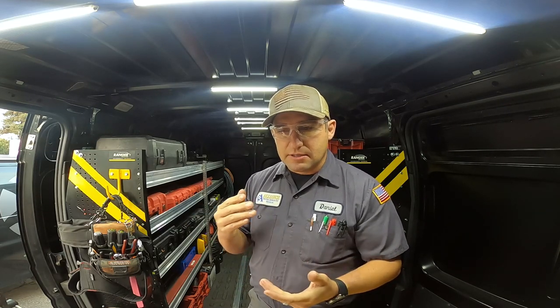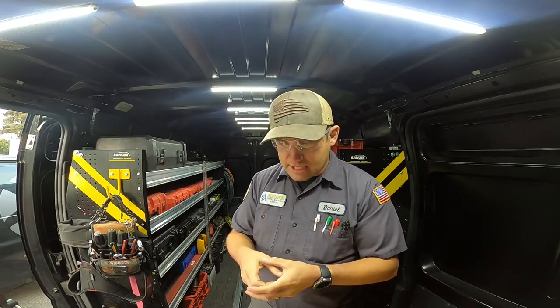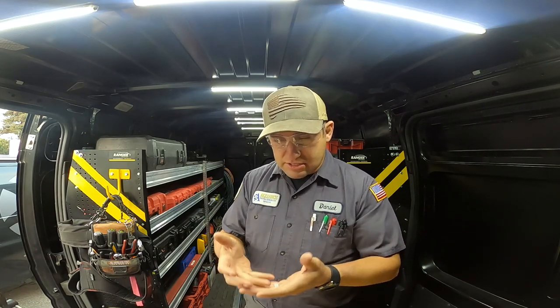And it just sucks that my customer had to pay almost $30,000 in Freon, and now he's gonna have to pay for all the repairs to replace the coil and all our labor to do all that. And it's because this fan motor has like a $2, not even that, like a 20 cent part in that thing that failed and allowed this rotor to fall out of the stator.